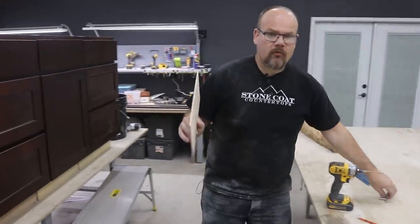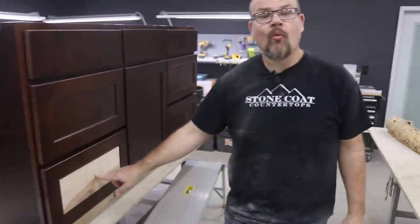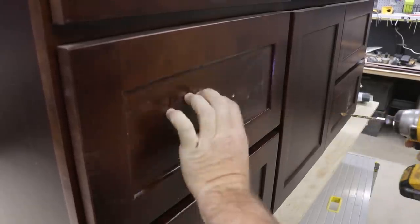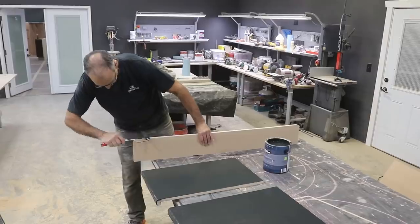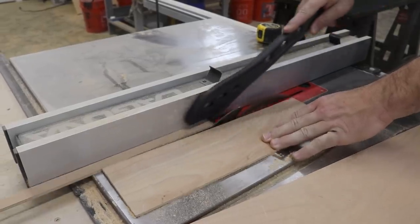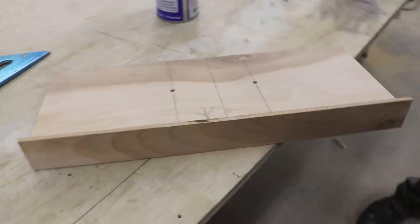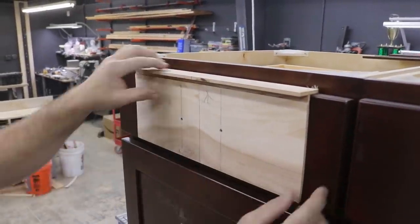Pro tip: when you're doing your cabinet hardware, if you want to get a perfect fit on your drawers, make a template. When I stick this up here I can only screw in one spot — this keeps you from ruining a perfectly good cabinet with cattywampus hardware. You can buy jigs at Home Depot but they've got a thousand holes on them, so you're just going to follow the wrong hole. It's easy to make one — measure here, line it right up, and then drill it.